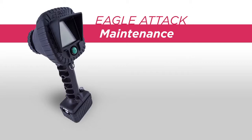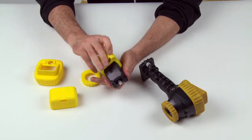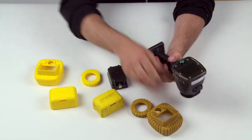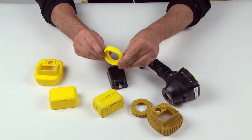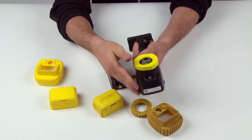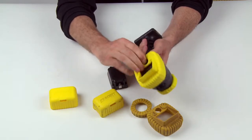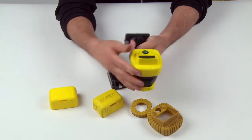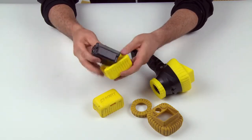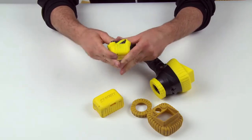To service the camera beyond these steps, please contact your local Scott Thermal Imaging Service Center. Bumper replacement is easy. The bumpers are available in multiple colors — for a complete list of available colors, please contact your Scott Thermal Imaging distributor. Simply peel off the bumpers that require replacement. For the lens bumper, find the text stating 'top' and orient this side of the bumper on top of the lens, and press until fully seated onto the housing. The glare shield replacement is quick and easy — slide on the top of the glare shield and work around the perimeter until the gasket is fully engaged, and press until fully seated. For the battery bumper, first locate the charging contacts and the contact access extrusion on the bumper, then install the battery into the opening of the bumper and gently work the battery into the bumper until fully installed. Verify the proper positioning of the mounting hinge and the charging contacts.